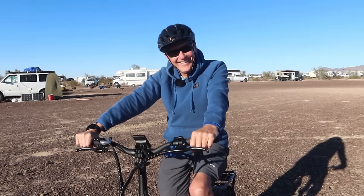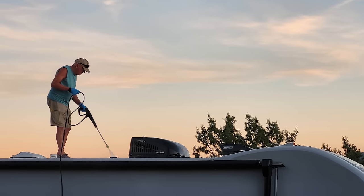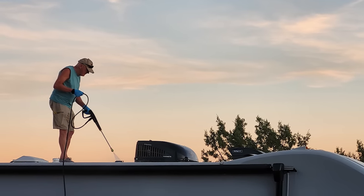The other two panels I have installed are the adhesive type. For roof prep, I had Kevin from Canada help by thoroughly pressure washing the roof with soap and water first. This RV does have a textured rubber roof, so it's perfect for using the adhesive, but it needs to be perfectly cleaned first. After the roof was washed and dried, it was then cleaned entirely with isopropyl or rubbing alcohol. It took about five quarts to do the entire roof.